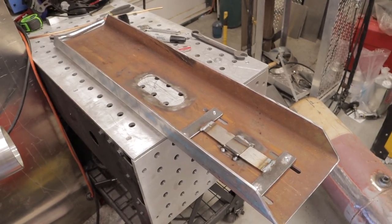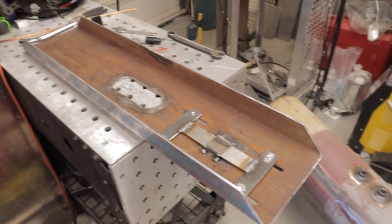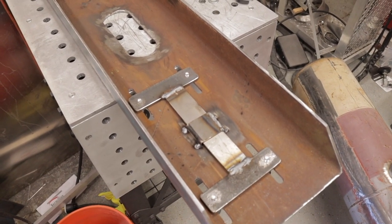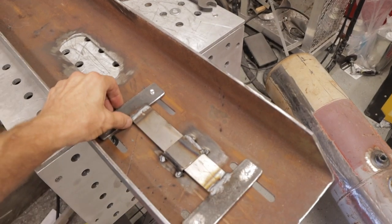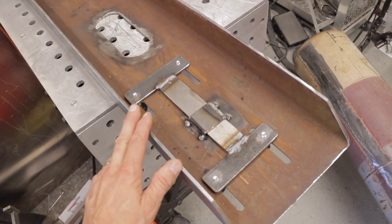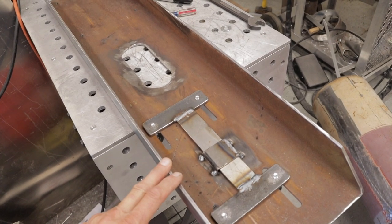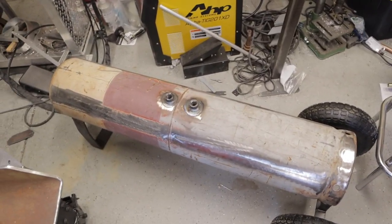So I just wanted to show what I'm doing on the bottom of the motor mount and compressor mount plate that's going to be welded on top of the compressor tank. Here is the compressor tank, and here is the flat mount that everything's going to mount on. On the bottom, I didn't want to try and reach in there and put a nut on the bottom of each bolt for the motor mount for the engine. So I made this plate that slides front to back, and I tapped each hole for the mounting bolts to mount the engine. That way I can adjust the belt and I can just set the engine on top, thread the bolts down in, and not have to worry about trying to align nuts and washers and all that. I just wanted to show that before I weld the motor mount plate onto the tank.